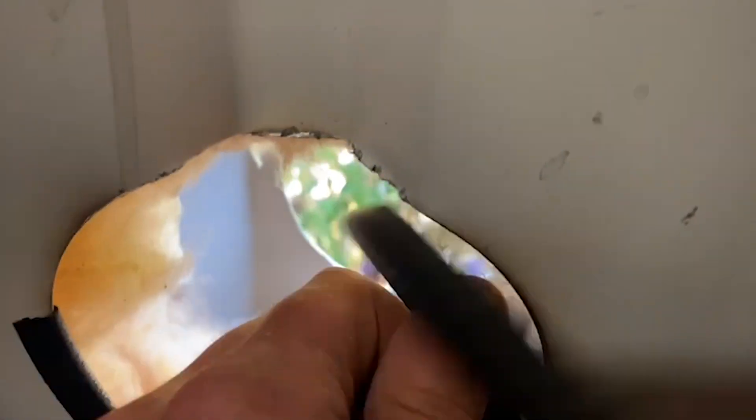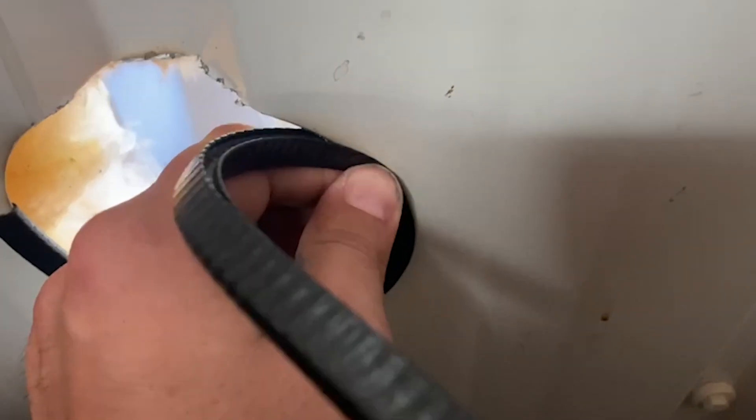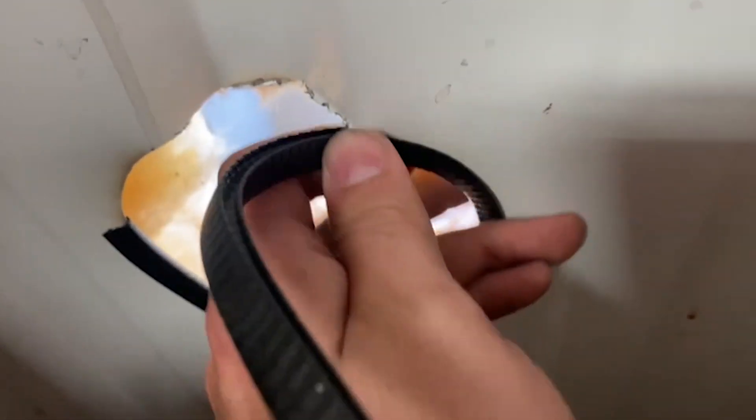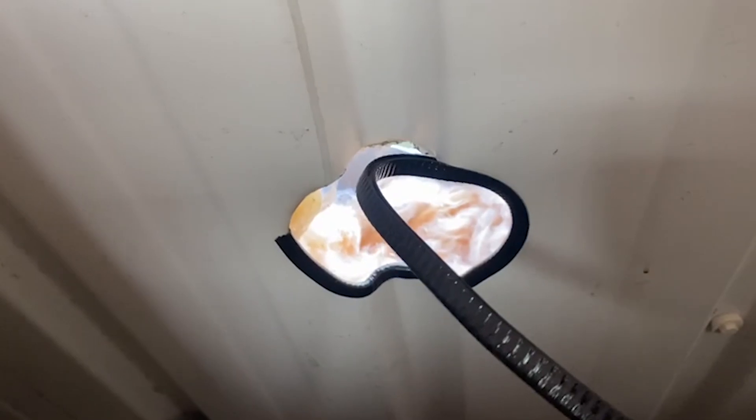They'll build a little shelter over the top of it. The grommet fits in really well — it's got little teeth inside that stop it pulling out, molding quite well to the metal. Once I get the cable through, I'll seal it with silicone on the side and put some fire sealant in there to stop that hole.